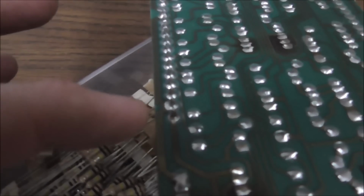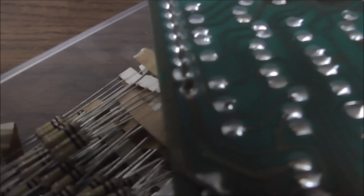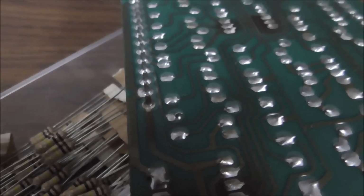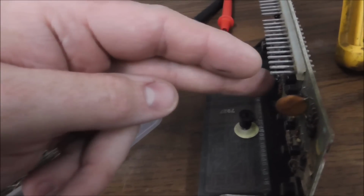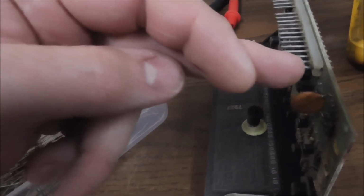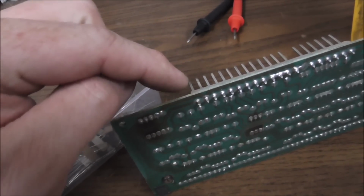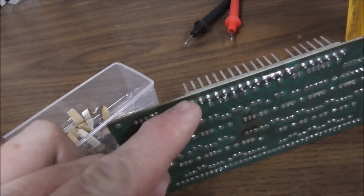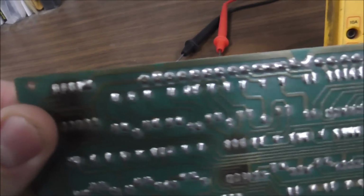Right. So anyway, the solder, it's a bad solder joint. It's just cracked loose. So the connector is sending whatever signal it sends in on that pin. It's getting onto the pin, and it's electrifying this entire pin, but it's not actually doing anything on the board because the pin is no longer touching the board, even though at first glance, it looks like it's fine.